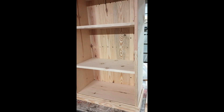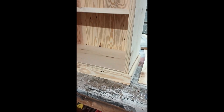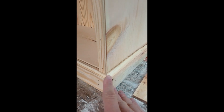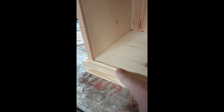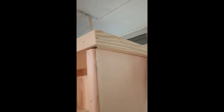The cabinet is complete as far as the build goes. I just have to stain it now. At the bottom, these are the pieces I cut out of pallet wood. I did 40-degree angles on them, got them on the router and cut a little groove into them all the way around the back side. Then I put these little strips on here to round it off at the sides. At the top I've also got pallet wood with a border around it, and the strips run down that way.